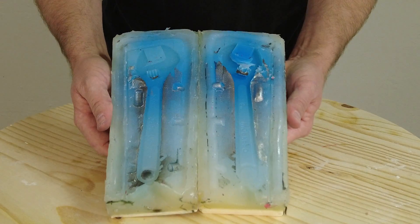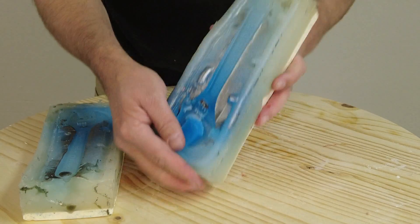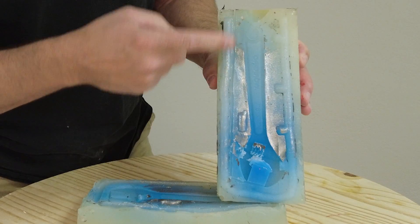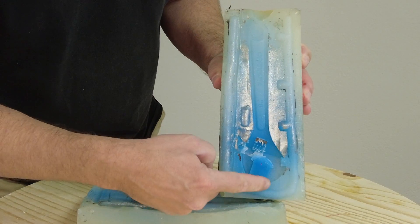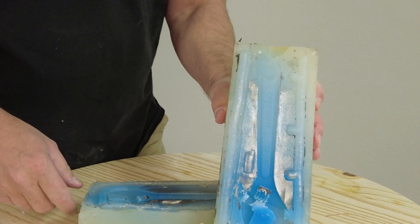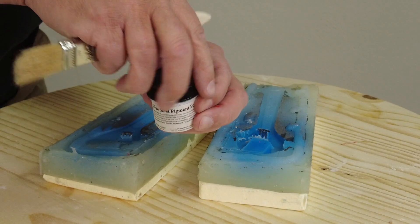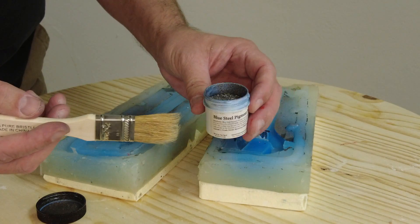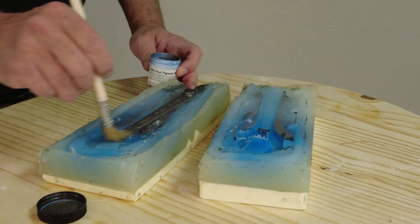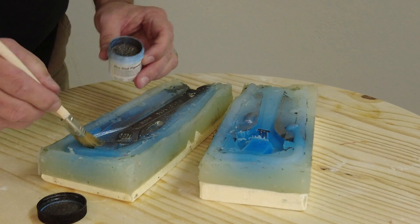For casting we're going to be using a 5130 silicone mold. 5130 is a platinum silicone, and we recommend platinum silicone for casting any of the FP series materials because tin cures can sometimes inhibit them. What I'm showing here is the vent system — those little trenches going up the side — which allows the casting material to be poured in and forced in with a syringe, while air comes around the side and up the top. Before we cast, we're going to brush a layer of blue steel pigment powder on both halves of the mold to simulate a metallic finish. Just grab a small amount on the brush; it sticks to the silicone and will transfer to the FP90.